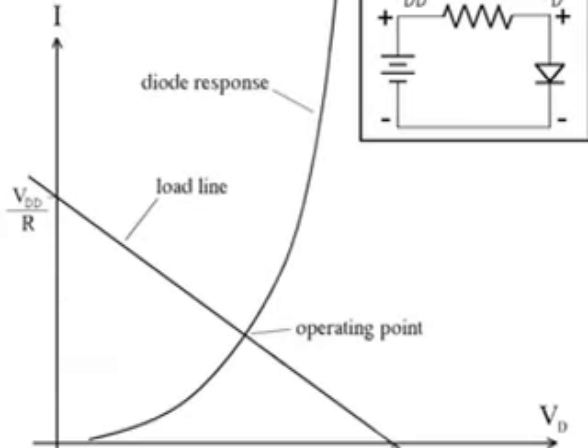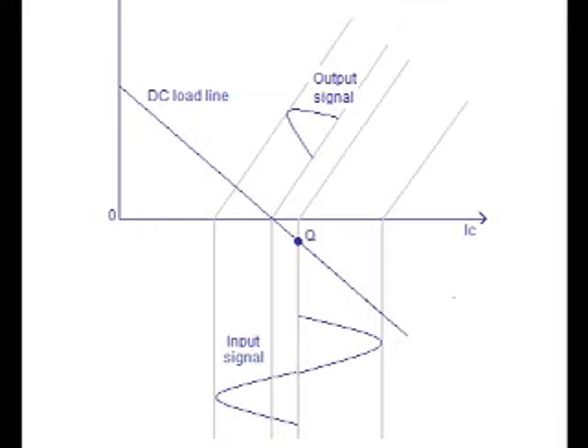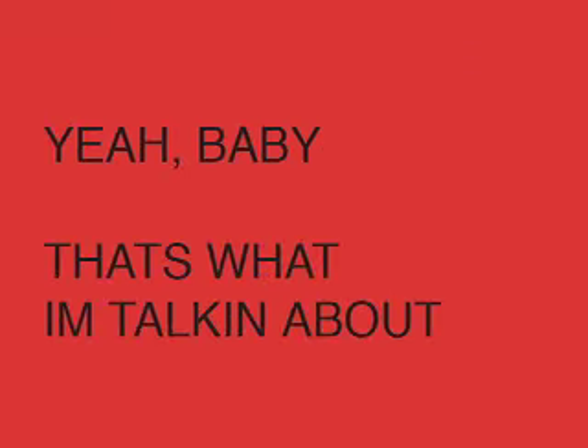The architecture of the amp is unique — something that's been rolling around in my head for a while, and I've utilized it in other amplifiers. It allows for a gain stage that is a little bit further downstream than your typical hot-rodded Jose Amp or Soldano or something like that. It's basically just prior to the cathode follower, and what that allows you to do is still jump channels and allow for that extra stage of compression to be in line.